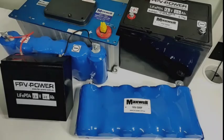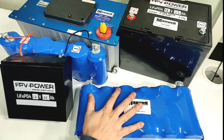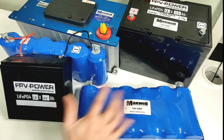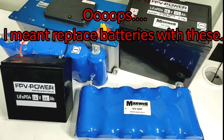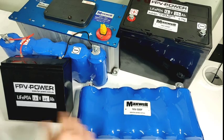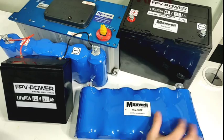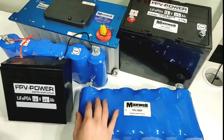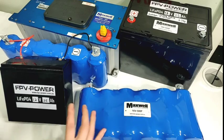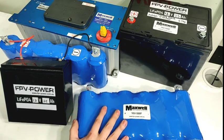various voltages. Moving forward, we've covered that these can dump a large amount of energy in a split second, and they can charge very quickly. But the question is, why don't we replace these with batteries and call it done and dusted? Because when you have a supercapacitor, the watt hours, I think it's about 3.8 or something watt hours as per the data sheet. And the 1,900 amps is in the data sheet, which you can get a hold of, and you can actually see what the specs are on these.